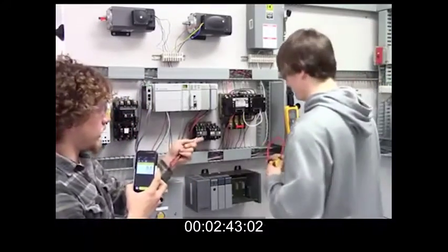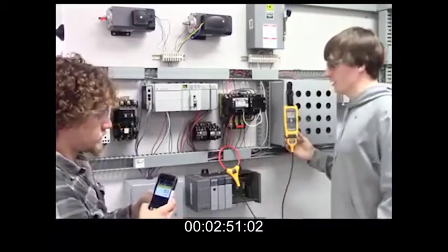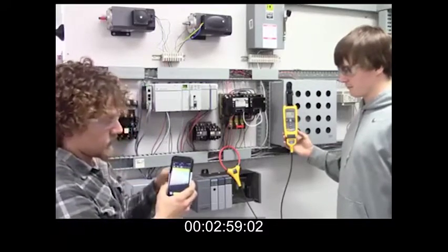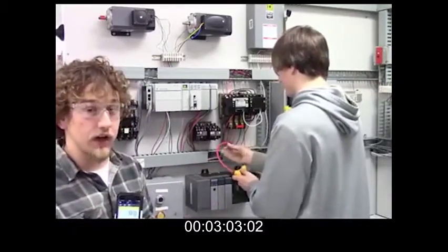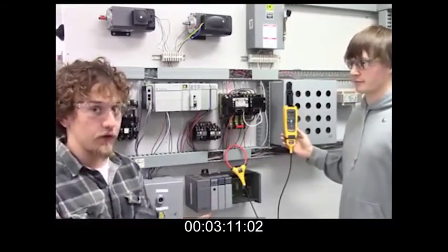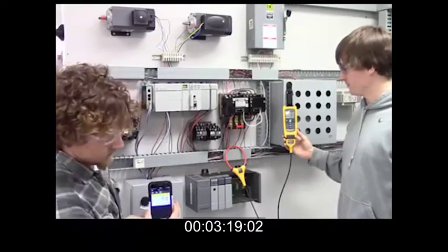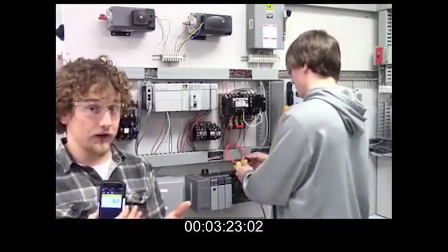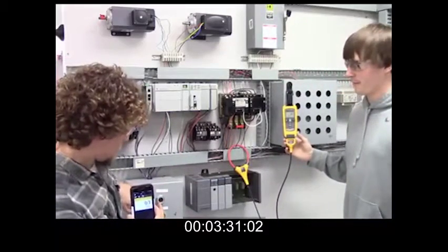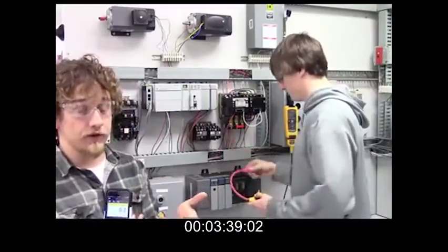What we're going to do first is go across the first phase of the motor, and we're going to go sequentially — one, two, three — and make sure everything's working. You can energize the motor when you're ready. What we saw was that the motor through phase one was actually drawing 150% of the FLA, or full load amps, which is a problem because you want it to just draw the full load amps and not too much more. We're going to check the second phase — go ahead and energize the motor. We didn't read any current across that one. So we're going to check the third one. And again, across the third phase we read 150% of full load amps.